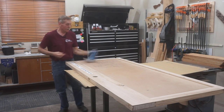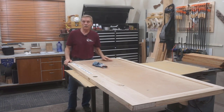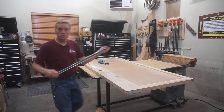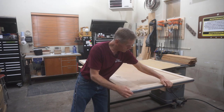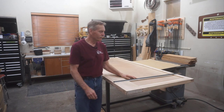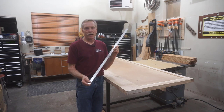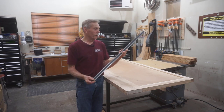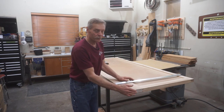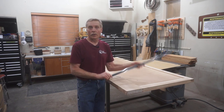There is certainly nothing light about that puppy, but having it on the bench or work surface like this is what makes it possible to install this door bottom. Here's the video sequence I shot that shows how I modified a stock MD door bottom into the configuration necessary to seal up the gap on the bottom of the door while at the same time preventing the hardware from showing.